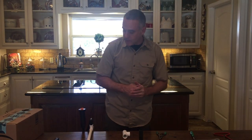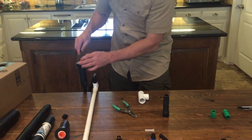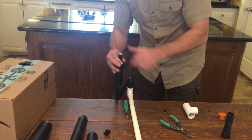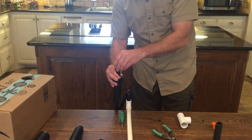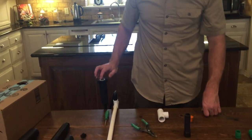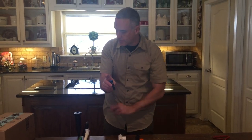The last thing is replacing nozzles — very simple. You can use a specialized tool that catches on the old spray head and pulls it up, or simply use a screwdriver placed underneath and pull it up. Then just screw off the old nozzle, take out the filter if there is one, put the new filter back in, and replace it with the right head. There are end strips and all sorts of heads — this one for example is a 12-foot quarter. Make sure you put the right nozzle back on and that it's pointing in the right direction. There are two basic types: one nozzle fits Hunter and Rain Bird heads, but not the Toro-style heads, which use their own type. Make sure you have the right nozzle for the head you have in the ground.